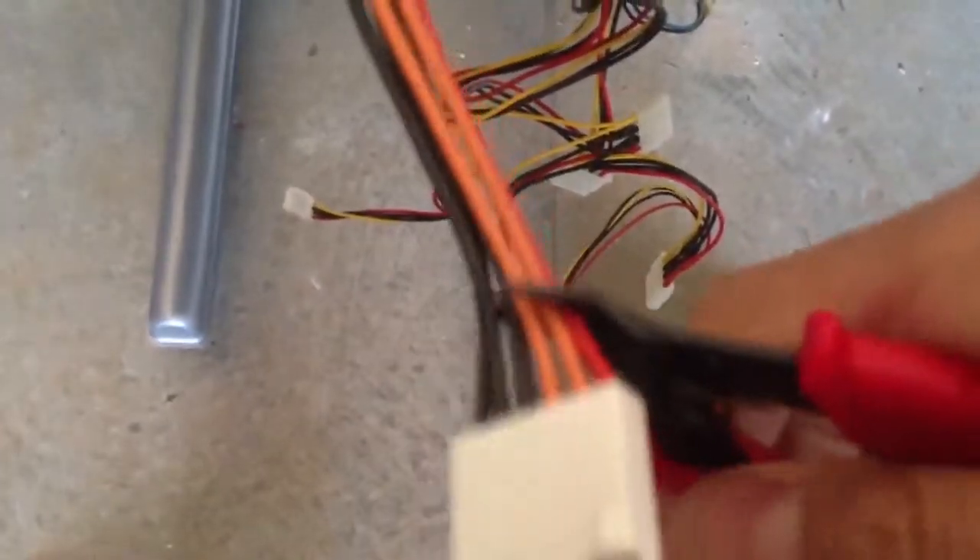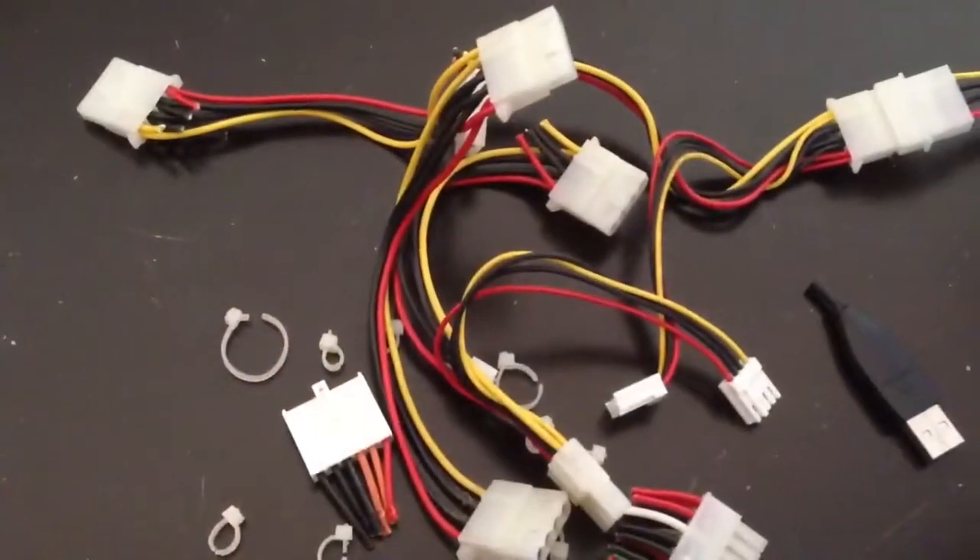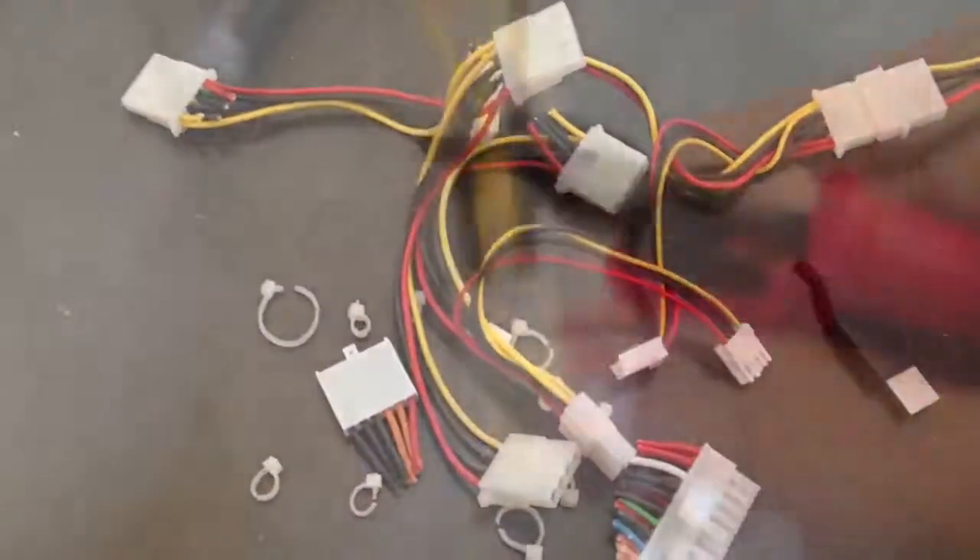What I'm doing is taking off the zip ties and then I'm going to cut off all the connectors. Then I'm going to pull the leads through into the case and cut them off right at the base at the PCB where they insert. That way they don't short out if they're near each other, since they're cut very low to the base.